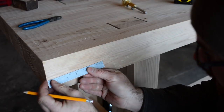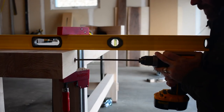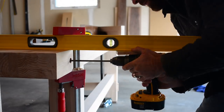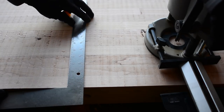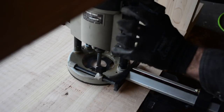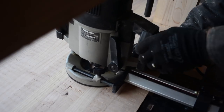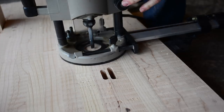Now we will lay out and then drill a hole to accept the sleeve which will house the mechanism for the vise. Clamping a straight edge to the bench that is parallel to the bench top is helpful to guide me while drilling the hole. With the hole for the sleeve drilled, now I need to create a space for the acme nut to be housed. It's important that this space be created precisely to hold the acme nut in place properly.